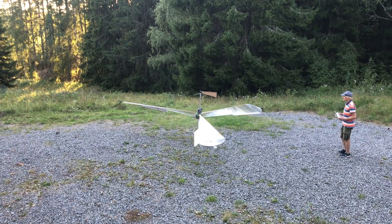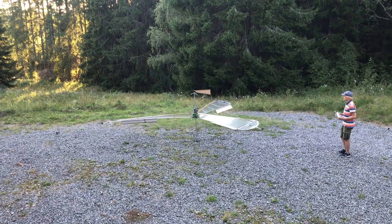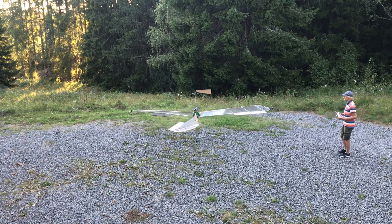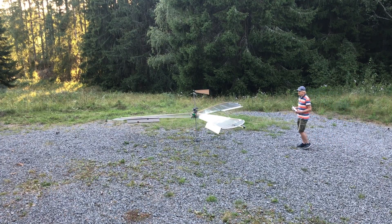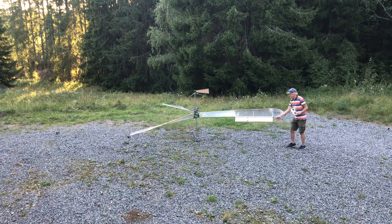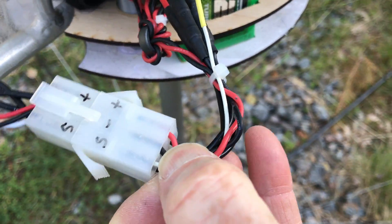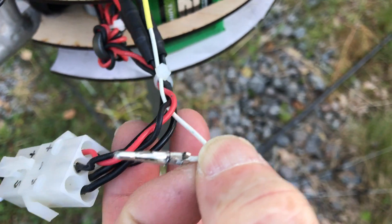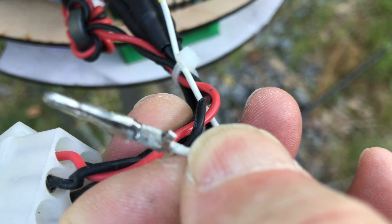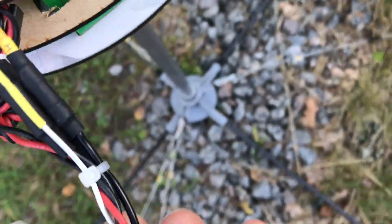So that was a second motor failure. And then I have also had significant trouble with the connectors. I assemble and disassemble this every time I fly, so I have quick connectors for the servo cables and the power cables to the motors, from the hub out to the wings. And this is not supposed to be able to happen. So I have some glitches from one time to another, and that's very sub-optimal. I really should change those connectors — they are simply not good enough for this.